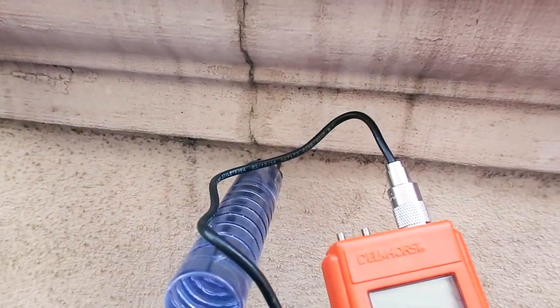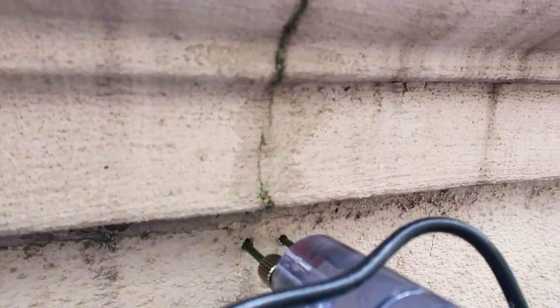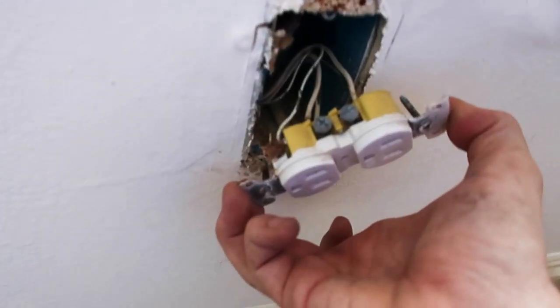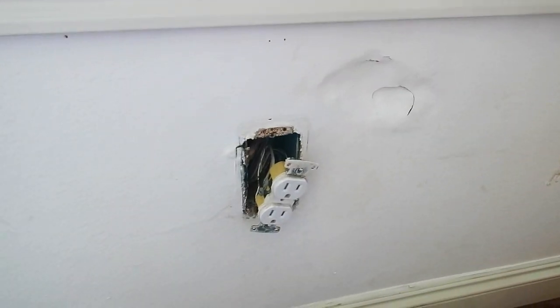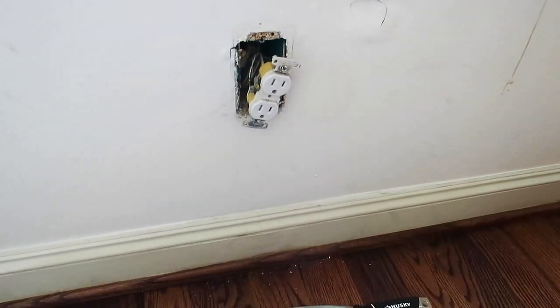On the EPS band I got a positive moisture reading — about 16.2% earlier. I tested this area because there's a crack here, a little bit of growth, and evidence of prior repairs. The substrate is solid, which is good, but the prior repairs have not stopped moisture from making it behind the wall. I'm going to recommend adding overhead flashing. Testing the window, you can see there's been an excessive amount of moisture making it through. I barely pushed on the wall right here and now we have a small hole — the amount of water damage underneath this window is significant and needs to be repaired.